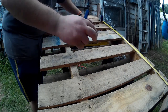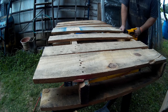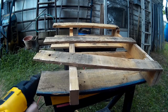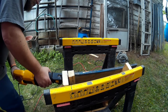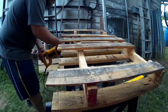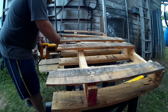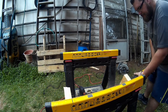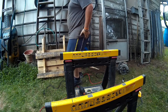I cut them to roughly the height I wanted for the desk. I used the sawzall just in case I ran into any nails, then cut the bottom boards off so it was more like table legs. You can see right there — that is one side of the desk. I did the same thing to the other pallet. The sawzall is awesome, and again I'm trying to use as much of the pallet's existing structure as I can to build this desk.